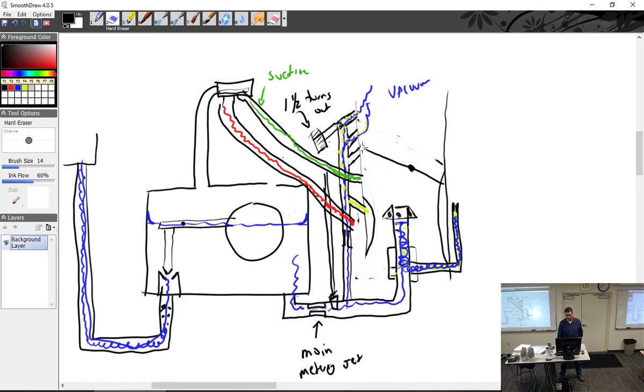All right, so when I open the throttle up, and I'm operating it, now we've got suction in here. Not a heck of a lot, depending if we're wide open. It's going to be about 1 inch of suction, maybe. Manifold pressure is about 1 inch less than atmospheric, but it's some, and it's enough.